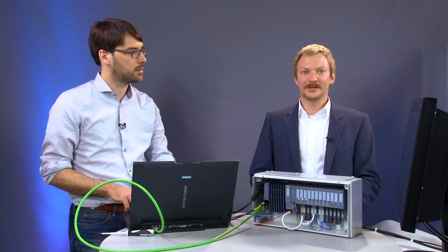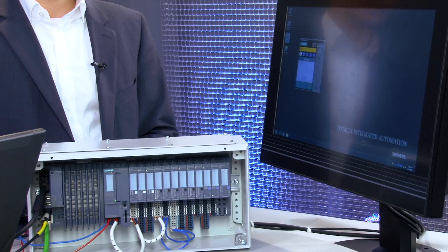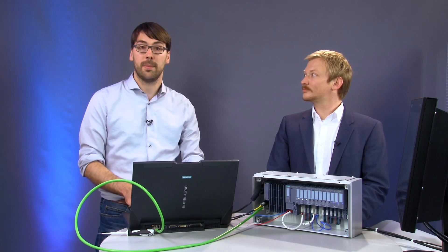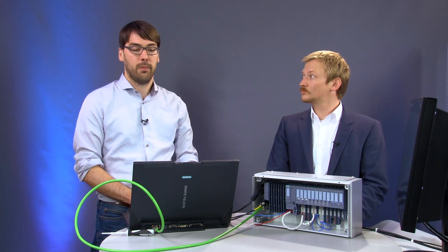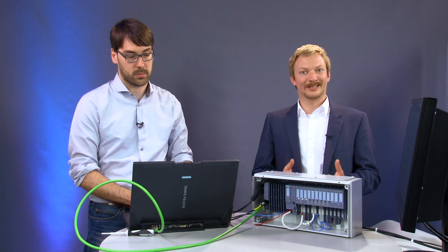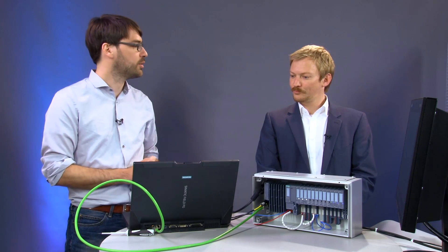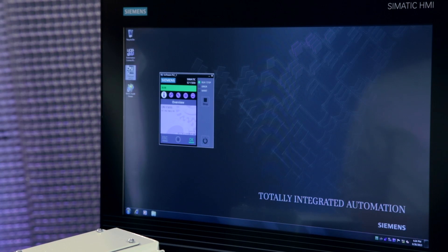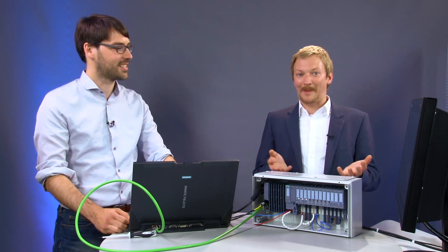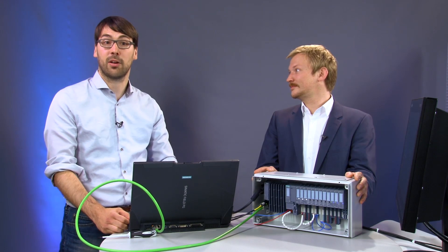After the restart, Windows is now fully loaded again and the software controller has initialized. We can see that the decentralized peripherals are now recognized as the LEDs are flashing. The CPU is currently stopped and no project has been loaded yet — I will do that now. As a final step, we complete the process in the TIA portal. What's left is to download the hardware configuration and the software, so we click the load button. The Step 7 project is now loading in the software controller of the CPU, just the same procedure as with any other Simatic controller. We are now done and have a fully functional controller. The display app is in run mode and the CPU controls the IOs — the run light is on. In conclusion, the controller based on the ET200SP peripheral system offers plenty of options with minimal space requirements, and thanks to the TIA portal, everything is up and running in record time.